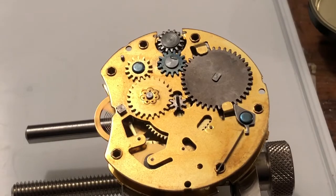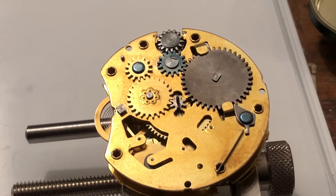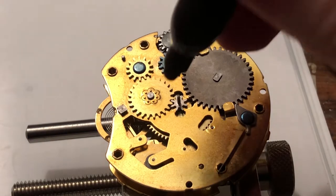One other big area I found that you need to oil is every second tooth of the escape wheel. So we're going to stop this and I need to put just a tiny little mark on this thing with — I'm going to use a Sharpie this time around — because I need to know how many times the wheel has spun, or if it's spun, or whatever.